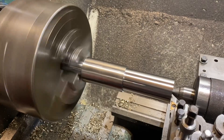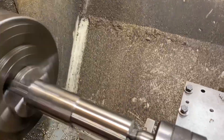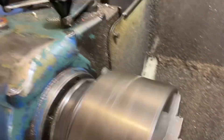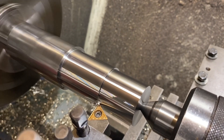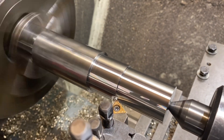So here we are, up to 900rpm, and now we're taking 3mm off the diameter in one pass. You can see we're back up to 100% - hogging beautifully. That's 40 Rockwell stainless steel.